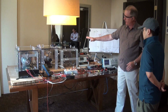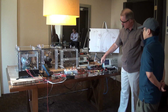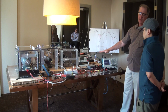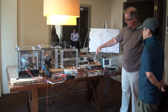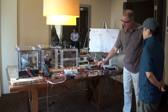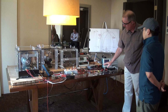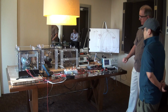So what I'm going to show you with this prototype has two coils in it. It has a conventional coil that's connected to this light bulb, and this is the conventional coil. When it's placed on load, the system will decelerate as per conventional regenerative braking. And when the yellow coil is placed on this load, we will see acceleration of the system, but this load current and this load current will be observable on the oscilloscope.